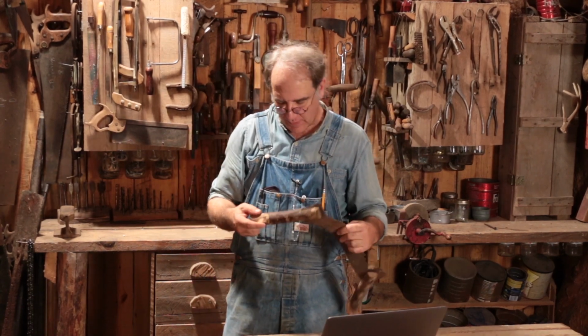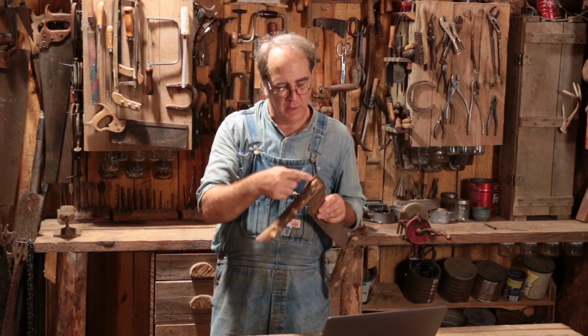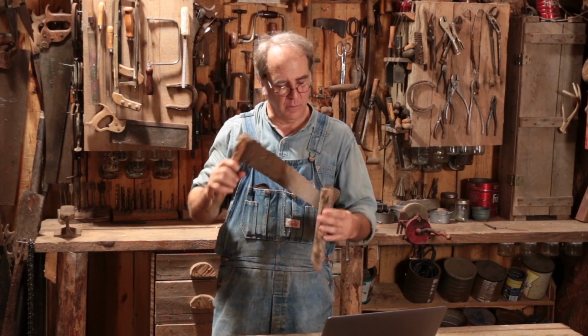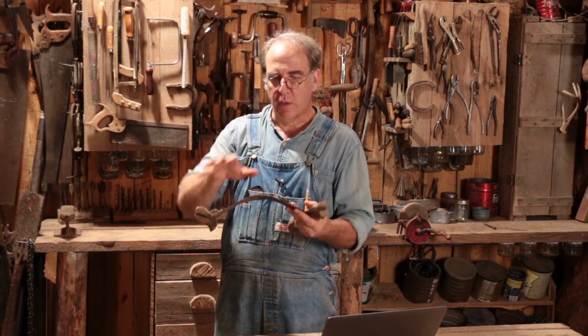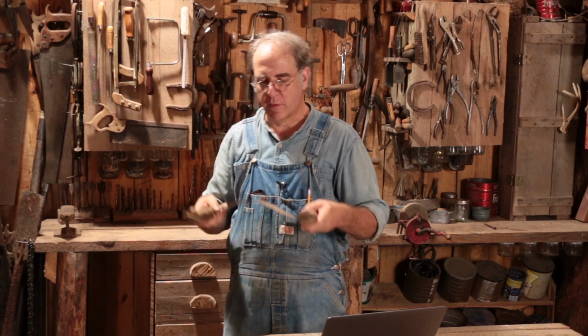And these look like sweet gum or elm saplings they cut, and cut a slit in them and put it up, drilled a hole in there. And a nail is holding this end on both sides, and made handles, made a little draw knife. The beauty is, unlike a regular draw knife, this has a curve to it, and so you end up peeling more of the bark off, more of the diameter of the pole with every turn.